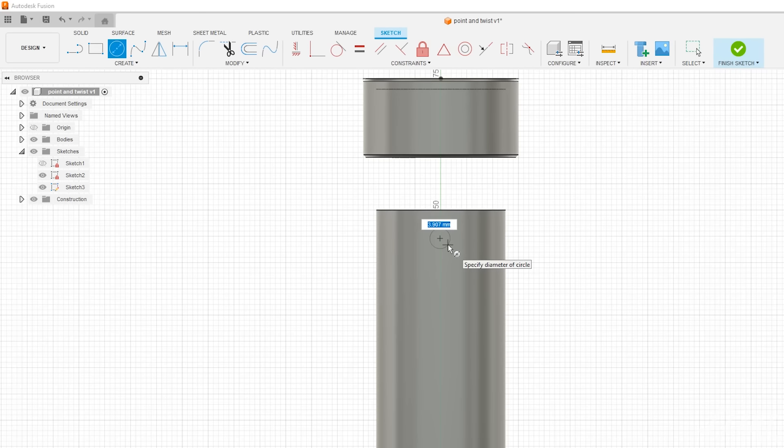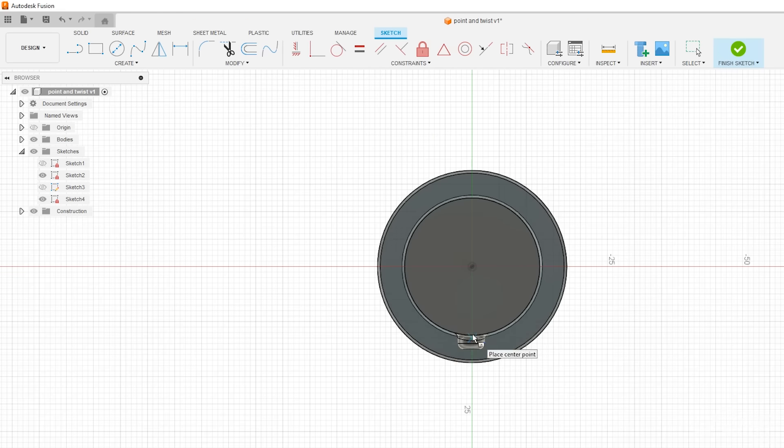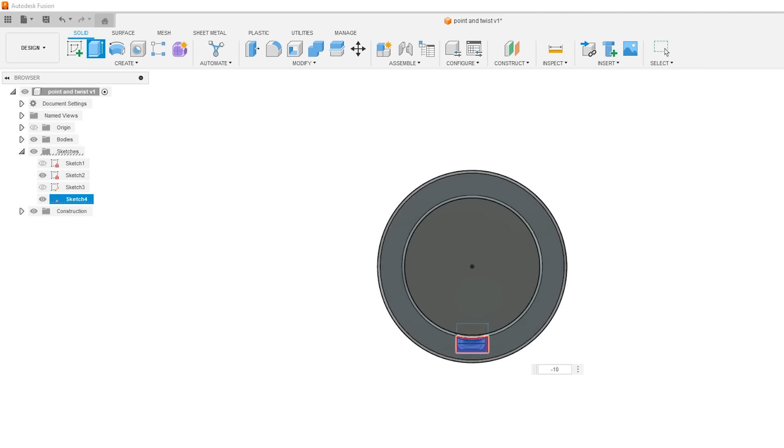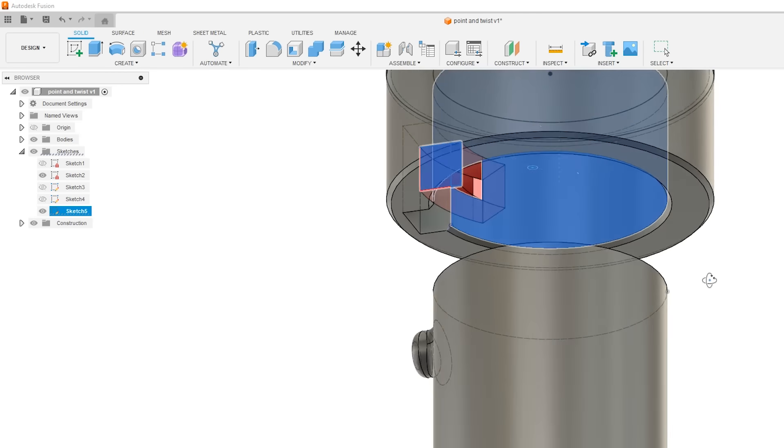Last but certainly not least, one of the more difficult to model but one of the more useful to have is basically what we're going to call a nub and slide. You design a little nub on the outside of the container, or on the inside, and then you have a channel that this nub locks into when the cap is pressed down and then twisted just a quarter turn to put on. This is really great for user experience because the user doesn't have to twist and twist or shove it on. It's very intuitive, very quick, and very easy. If you want the lid to tighten down you can change that channel to have a little bit of an angle to it, and you can also put nubs inside of the channel to have it lock in place.